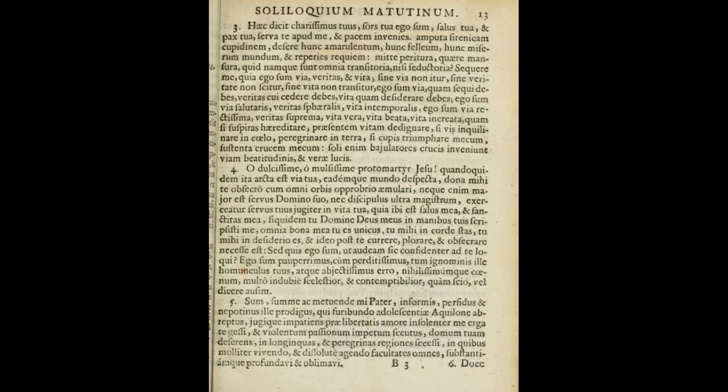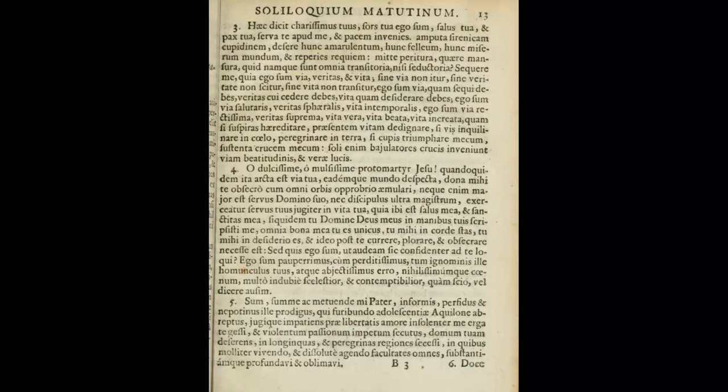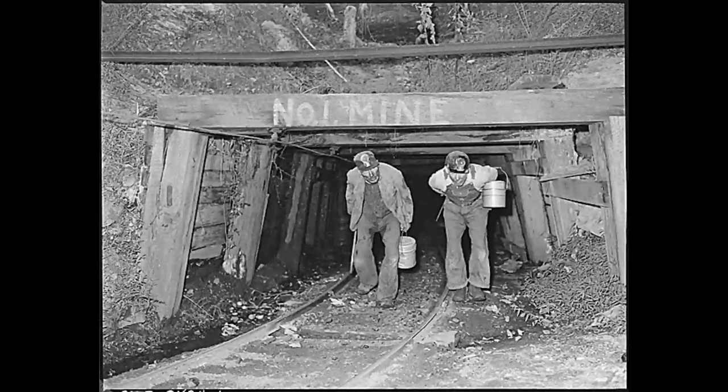Time to corrode equals volume / (surface area * corrosion rate). Time is almost equal to 33.6 / (62.5 * 0.0013), which is almost equal to 413 years. This is a very rough estimate and likely an overestimate because 1. The actual surface area might be larger if the ingot isn't perfectly smooth.